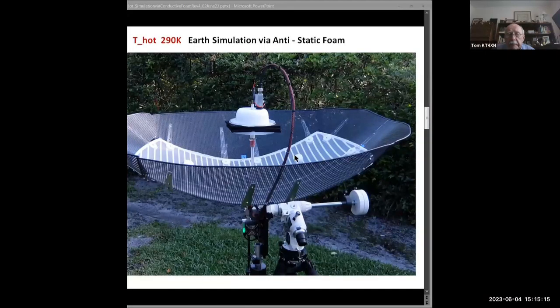Well, let me just share this one screen. This is lined with aluminum window screen, because I was getting some feed through these slots of ground noise. That dropped the cold sky about 1 dB, because I was getting 290K through this mesh, these long slots.